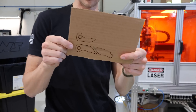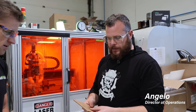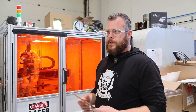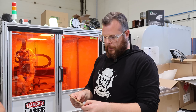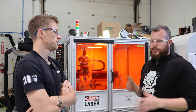Angelo and Grayson have been experimenting with laser cutting. We wanted to cut these out. We don't have any experience lasering paper or this type of material, so we kind of just Googled it, went on some websites, got a baseline to start with. With the laser you've got cutting speed, power, and focus height. So we just dialed it in.